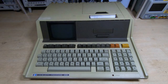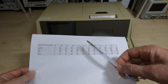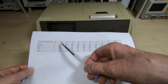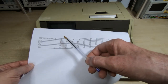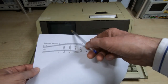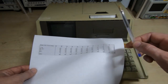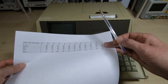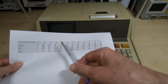It turns out there's quite a fine window of operation as to what people will accept to find a keyboard nice to use. I've printed off some of the results — they were quite surprising at the time. The firmware recorded the time each key was pressed for each individual, who was typing, how long they pressed the key, and how hard — there was a force sensor. The summary shows the average product of force and time the key was pressed — how long and how hard — averaged across all keys on the keyboard.